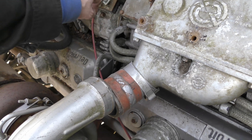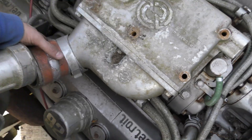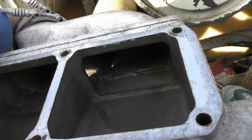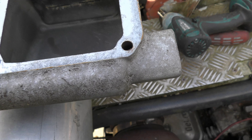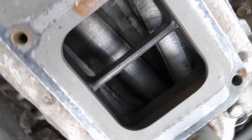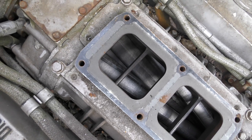I've slipped this down and taken off the bracket that holds that and the spring for the throttle return. I've taken these six bolts out and it's come free. So there we go - there's the inside of a Detroit blower, there's the inside of the housing. I don't think I have the right gaskets, so we'll just have to use the ones that are on it, which is a bit of a bugger. There's a little bit of oil in there but nothing too terrible. I'm actually fairly pleased about that - I thought it was going to look worse.